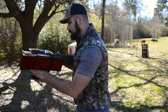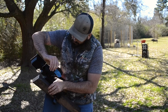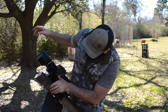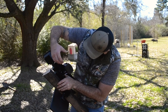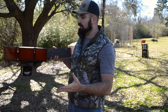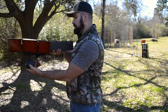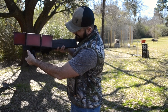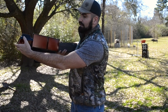All we do now is get it all lined up. There are switches down here so you can set it on high, low, or medium sensitivity. We're going to put it on high and set it to 120 seconds — so as long as something triggers it, it stays on for 120 seconds, and more activity will keep it going. You can also pivot the motion detector front to back and side to side to get it exactly where you need it, and each one of the lights pivots independently.